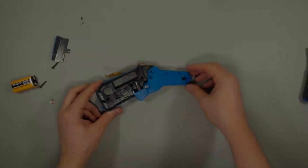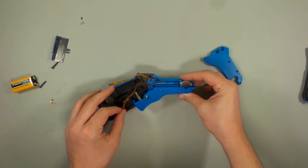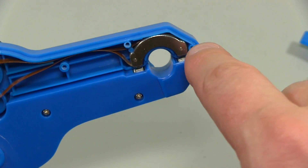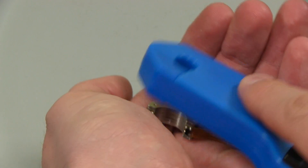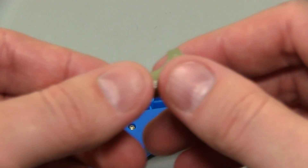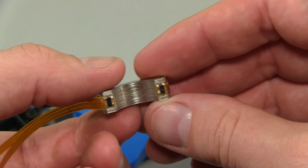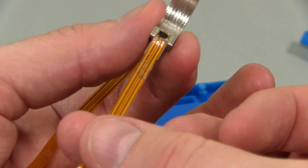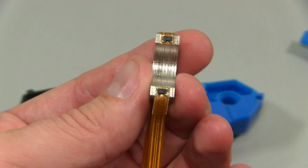This is the jaw section - I've taken the screws out so we can remove the lid. I previously assumed one ribbon cable was for the lower jaw and one for the upper jaw, but it looks like the lower jaw is just the core, and the upper jaw actually has both flat flexes going to it. Popping that out, you can see there's a transformer core - this laminated metal forms the current transformer. Then there are two little ICs marked 'SE' on each one with four pins, and you can see each flat flex has four conductors going to them.